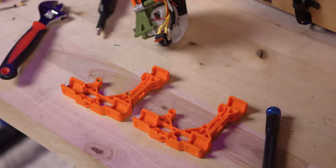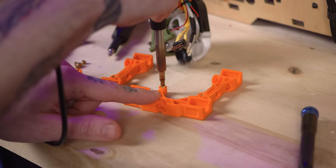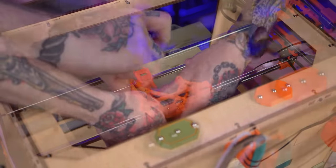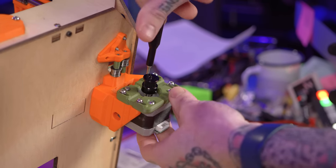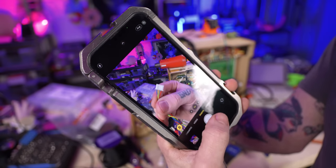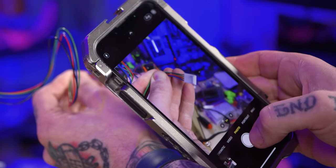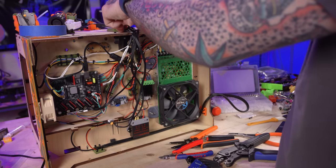See the previous video for the tolerance issues I ran into. Now I install the handful of heat press inserts required for this design so the carriage and tool head can be screwed together. This clips onto the three linear bearings for this configuration and it is so much tighter than the previous tolerances — this is way better. With the belts out of the way I can get the old motors off. I'm going to reuse the pulleys on the new LDO motors so they have to come off the old ones. Pro tip: I took pictures of the connectors and wire orientation before disassembly so I can easily reassemble them in the correct order. I use PET braided sleeving to sleeve the wires on the new LDO motors and begin cable management.